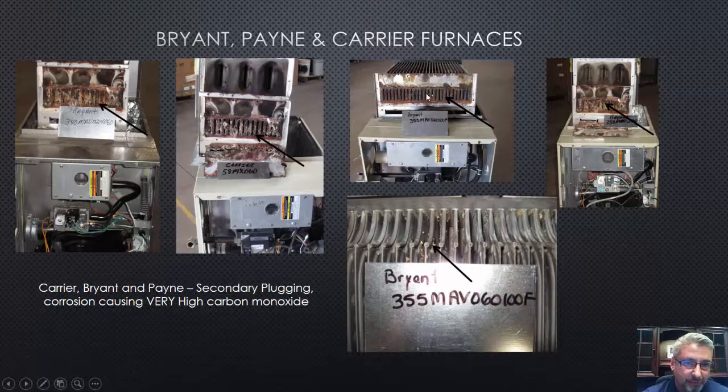Here's one that plugged, and here's another one that plugged. Here's your primary, and this is what the corrosion will look like — this is out of a Bryant 355 MAV, a 5-ton blower-drive 100,000 BTU. You'll see the little corrosion marks — that's what you're going to see from polypropylene breakdown. That's the Bryant, the Carrier, and the Payne. On the Payne model, I think it was a 490 — it's that 40-inch tall furnace. Here's an MCA Carrier; you can tell it's 40,000 because of how small the burner box is. This one's 100,000 — look at how wide the burner box is.